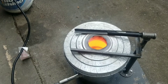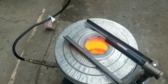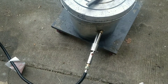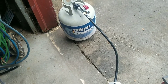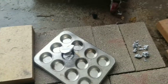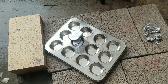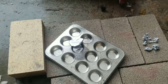I've had this burning for a couple of hours now. It went from being a dark gray to a white inside, and it is glowing very steadily right now. Everything is hot on this. The burner stays cool except the very end, which is super super hot. The propane is probably about ready to start sputtering because it's getting pretty cold. I melted down a few aluminum cans as my initial christening for this furnace and poured one ingot. It's probably going to be the ugliest thing I've ever done, but it felt like a triumph — I'm pretty happy with it so far.